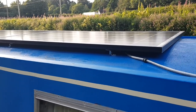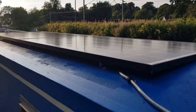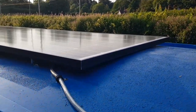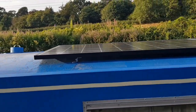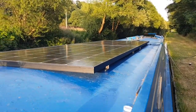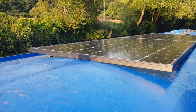It uses two large domestic-style solar panels — 305 watts each. I've mounted them using my own bracket set. It's basically impossible to buy brackets that properly mount these larger panels to narrowboats. You can get tilting brackets, which are very good, but for a panel like this and an installation like this...